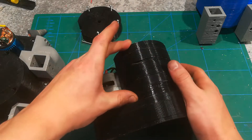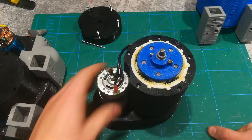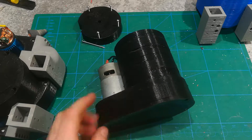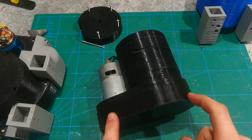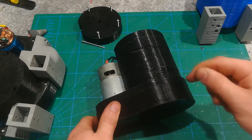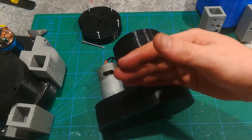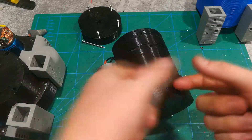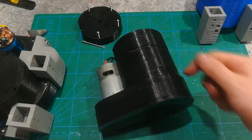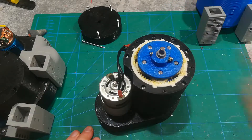In these sections right here, you cannot have anything go wrong if you build it like I have. The only problem with this gearbox is this 2-to-1 reduction right here. Sometimes this bigger gear might not be aligned with the center of the axle, and that's why there are three alignment screws on there — you might have to turn them to make the gear not wobble. But that's essentially all the tuning you'll have to do to this thing.